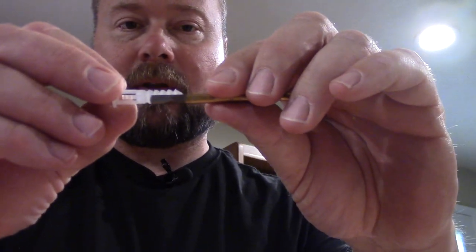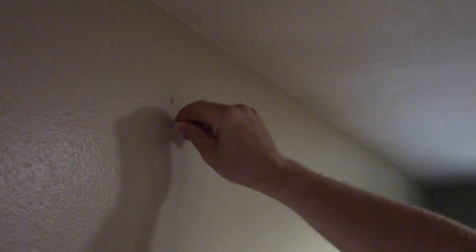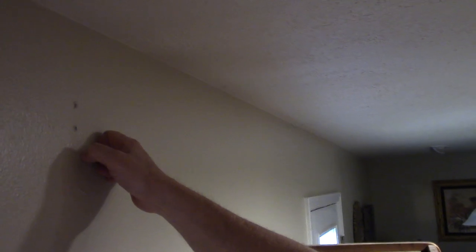I've got a little instruction pamphlet — it's asking for a three-sixteenths inch bit. Now three-sixteenths is just a hair smaller than a quarter. That actually looks a little small for it, but this needs to go into the wall fairly tight — not so tight that you're breaking the wall or breaking the molly to get it in, but if it goes in loose it's not going to expand correctly, it'll just be sloppy. So let's try this bit and see what we got. Okay, I don't think so — let's try the quarter. Now before we go too far, we're going to go ahead and test that to make sure I didn't make a mistake. Good and stiff, but it actually can go in — the quarter inch is the better choice. So let's go make all these quarter inch.